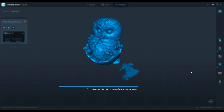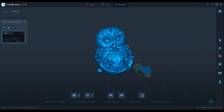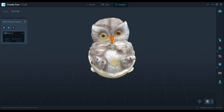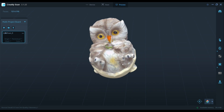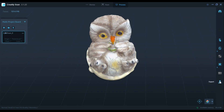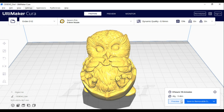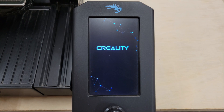There's also an option to fill holes in the model caused by insufficient scanning, and to close the bottom of simple objects like this owl to make it ready for 3D printing without any need for CAD software. After meshing, color mapping can be done as well. A couple of features are off slightly, probably due to losing tracking that one time, but overall it did a really good job mapping colors and the model turned out great. I then imported it into Cura slicer software, selected the Ender 3 V2 profile and 0.16 millimeter layer presets, previewed the layers, exported the G-code to an SD card, and printed it — which took roughly eight hours to finish.